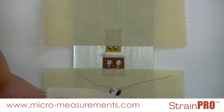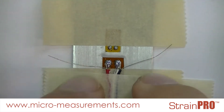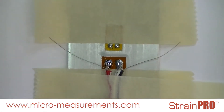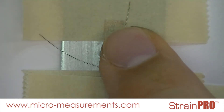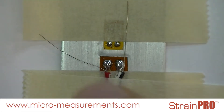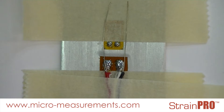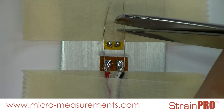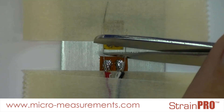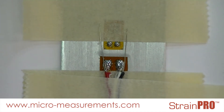Let me zoom in. Next I will reroute these small wires up towards the top of my strain gauge and cut off the excess such that I'm left with the wire coming up to about halfway up the sensing grid of the strain gauge. Protecting our strain gauge with our paper drafting tape is key here so as not to damage the sensing grid.